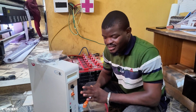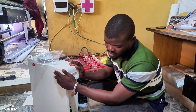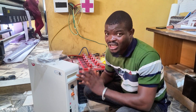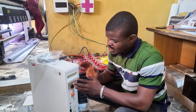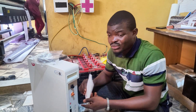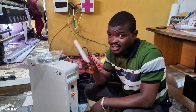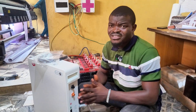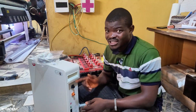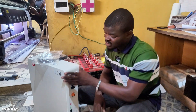The second thing I don't like is that it's not very user friendly — there's no display. That's fine, but at least they should provide an app so we can communicate with the battery and know what's going on inside. These indicator LEDs — when they blink, you have to rush to the manual to find out what it means. If I misplace the manual, I have no way out. Battery technology has reached a stage where a simple Bluetooth connection and a basic app should give us access to the BMS, so we can see what's happening with the cells.